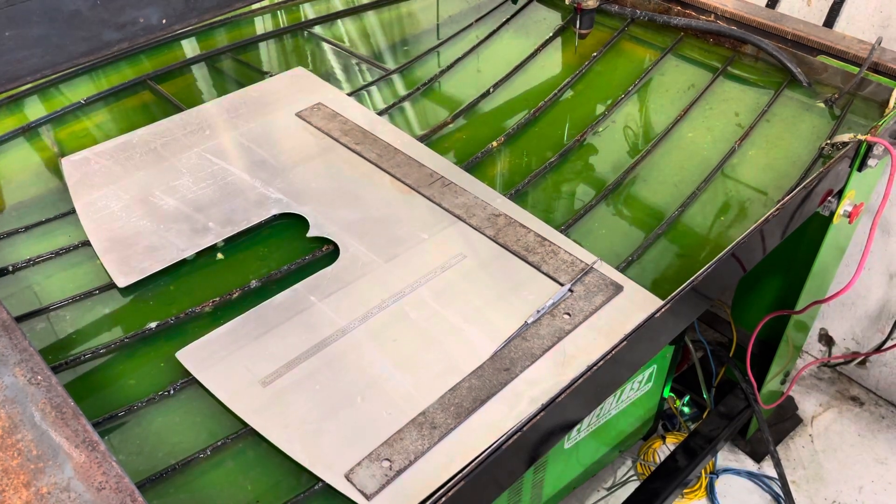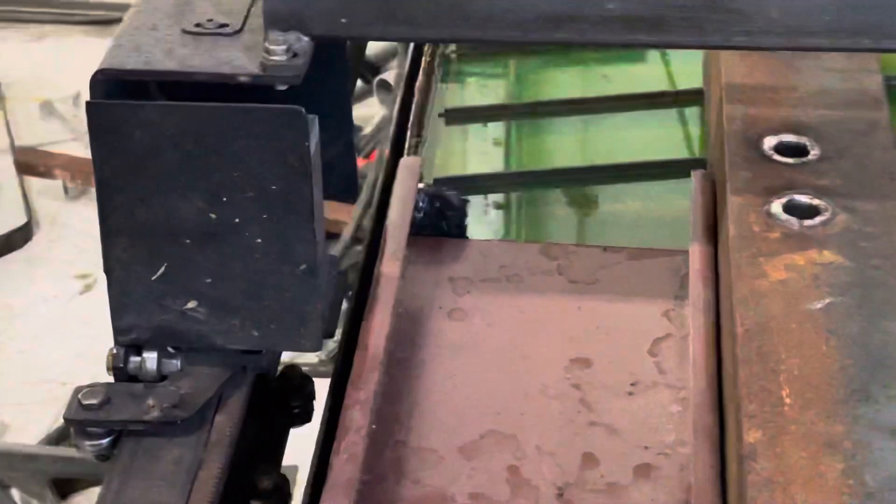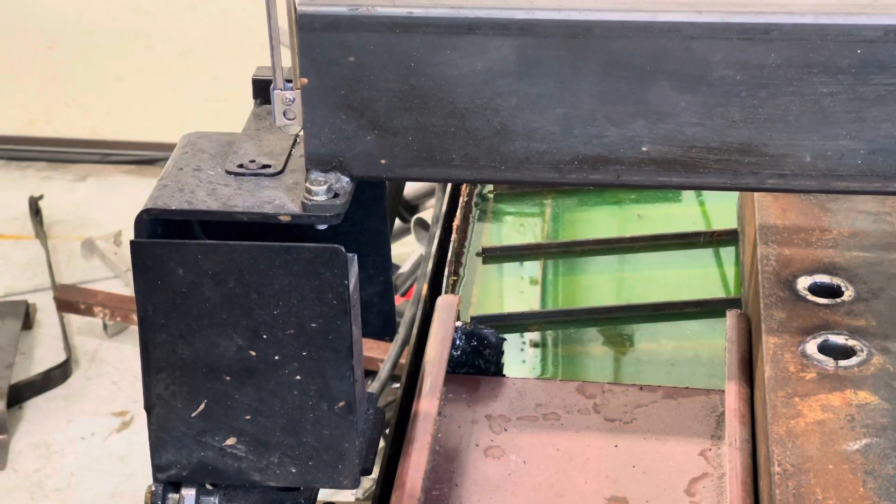In my case it did not, so I had to unbolt it — I'll zoom in to show those bolts. I unbolted them and canted it enough to zero it out 100%. I had to take a die grinder with a tungsten carbide bit and open up the slots.